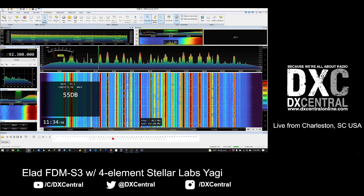The reason for focusing on SDR is how much easier it makes it to do the DX - to identify an opening, DX during the opening, and even after the opening, because you can record sections or in some cases the entire FM band and do that review at your leisure and get more stations in your log. Some of what we talk about will also apply if you don't use an SDR.